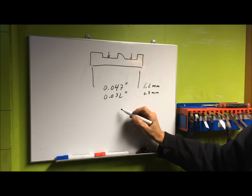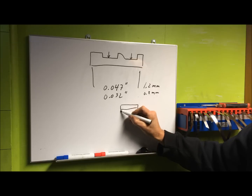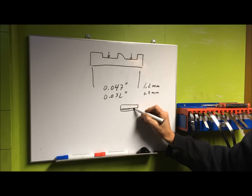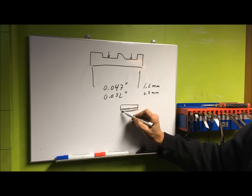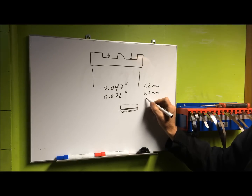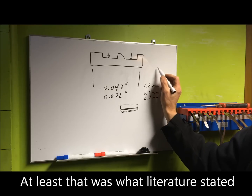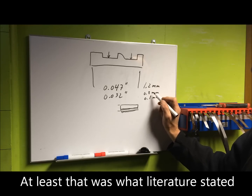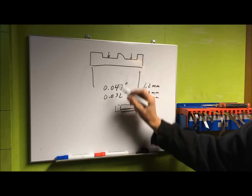The Turcite — or Rulon actually — consists of a wear layer on top, and then just a backing layer that you use to bond and glue down. So you have to take this thickness plus the glue, and I have found that the glue nominal is normally just 0.1 mm or so. So it's either 1.3 mm or 0.9 mm — roughly 1 mm in thickness all together — which I need to mill down.